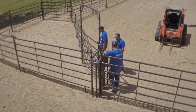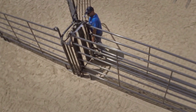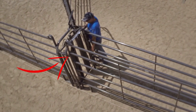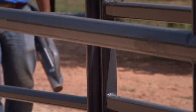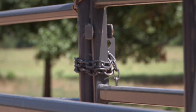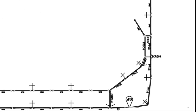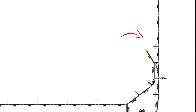You're now ready to finish setting up the stripping chute. Begin by attaching the 12-foot Premier panel on the back side of the stripping chute. Make sure you attach it on the inside of the tabs on the stripping chute release gate. Now attach the 12-foot gate on the front side of the stripping chute release gate, making sure you place it on the inside of the tabs. Next, place the stripping chute entry frame on the back side of the 12-foot Premier panel and 12-foot gate. You will use the cups on the stripping chute entry frame to secure the 12-foot Premier panel and the gate to the stripping chute entry frame. While setting up the stripping chute, you'll keep the back side of the chute lined up with the string line on the back side of your arena. You may want to attach a wing panel onto your stripping chute to make it easier for cattle to find the entrance.